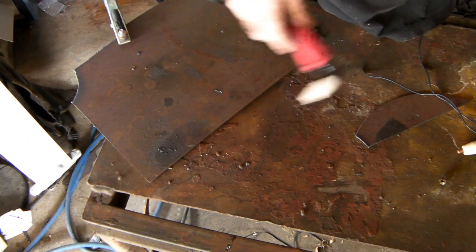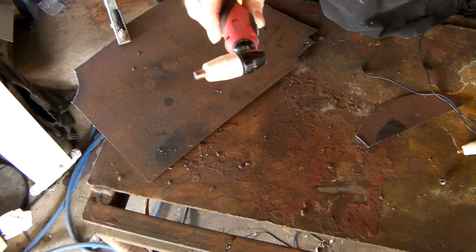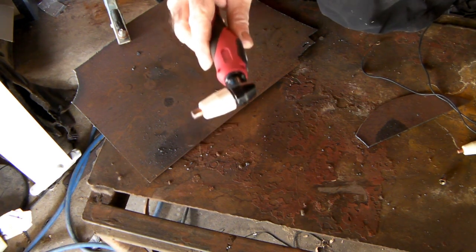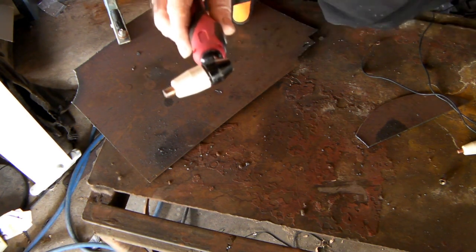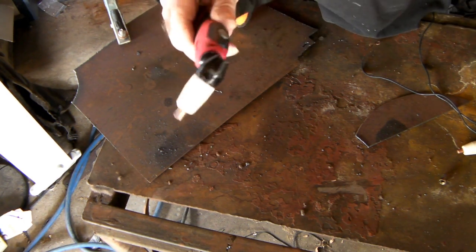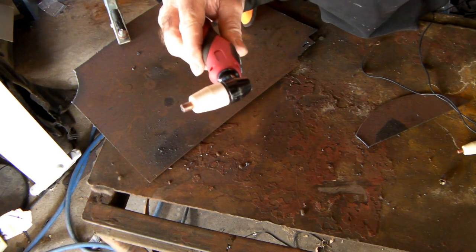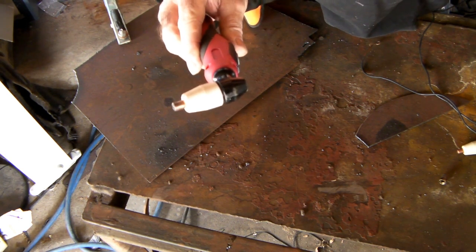A non-Pilot Arc. So the difference in these things depends on what you want to cut. If you want to cut rusty steel and a lot of painted steel, you're better off with the Pilot Arc. If you want to cut new steel or just a little bit rusty steel like this, then you can use a non-Pilot Arc. So that's the difference really. A lot of you guys have asked me to explain the difference — well, I hope I have in my own way. It's probably as clear as mud.